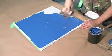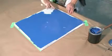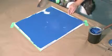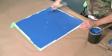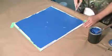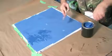Always use the tools and trowels you feel comfortable working with. For this sample, the applicator has chosen a taping knife or broad knife. When working with this type of trowel, remember to always use only one side of the trowel, as it will become honed on that edge, making for a smoother application.